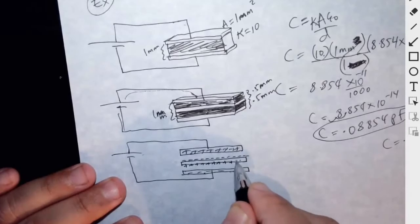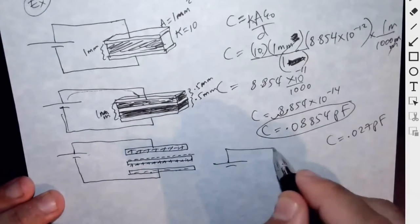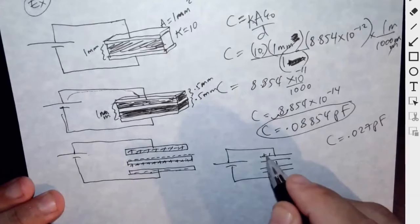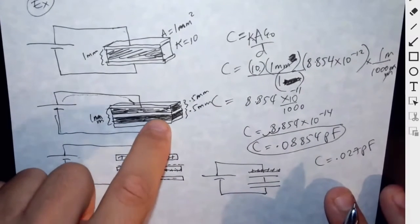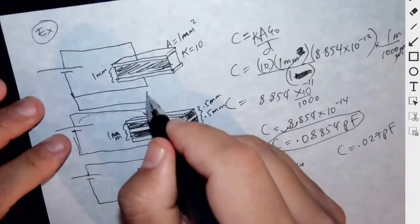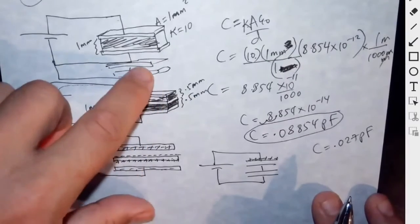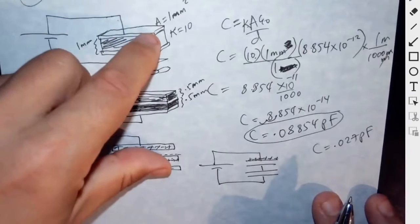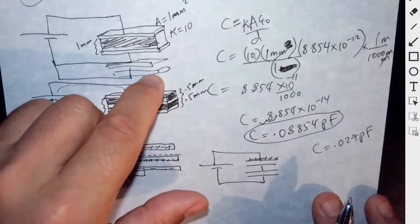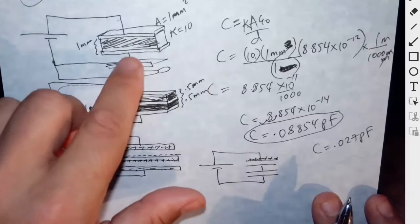Aha! This is really deep understanding, guys. So it has the equivalent effect of having two separate capacitors in series. It looks like cheating. It's almost like saying, I'm putting one metal in there, and it's almost like taking two separate capacitors. You see what I'm doing? To have two separate capacitors in series, I would need four plates. 1, 2, 3, 4. You see? But that's a waste of space. Why don't you just insert one? And plus, you're wasting metals.